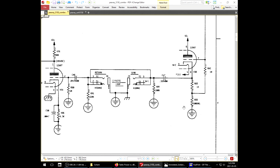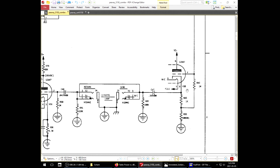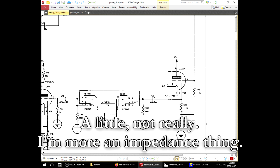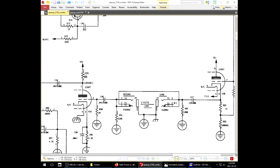My Simpson 260 meter — this old vintage unit — actually has dB measurement capabilities on it if you set it to the 2.5 volt AC range. We're getting like almost plus 10 dB. Now if we take a quick look at how some other people do this, I'm going to look at the PV5150, because according to some historical research, apparently the 5150 is based on this amplifier. Van Halen used to use an SLO and then he copied it and made it his own at some point.